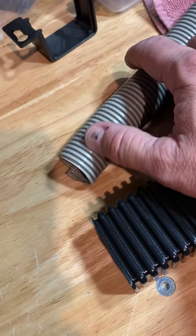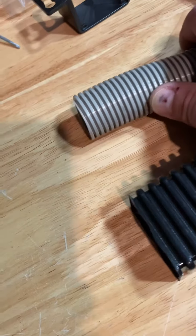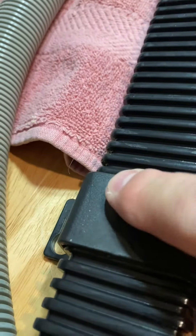But what's really unique about it is, unlike this gray conduit which we normally secure with a zip tie — and it sticks above the entrance to the back box, just an ugly look for me — this particular company makes a bracket that has lines in it that go into the grooves of the conduit. Once it's in there, the bracket doesn't move, and nor does the conduit.